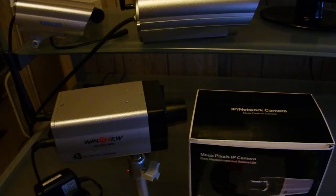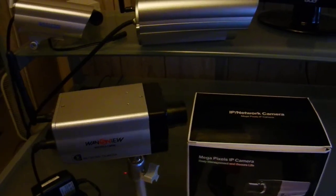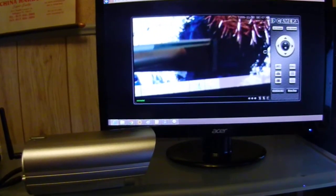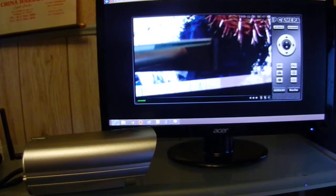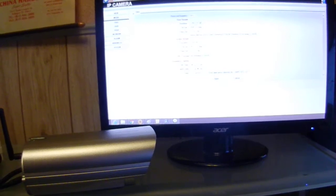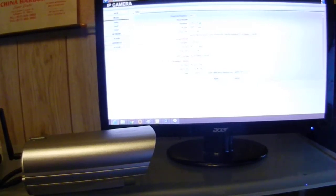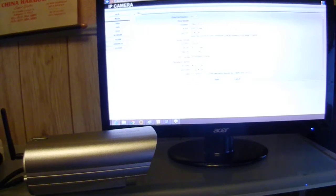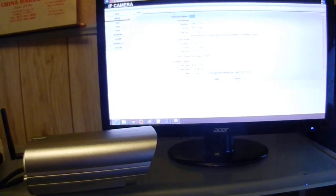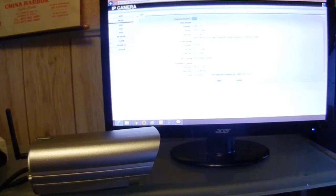The camera is a great little camera — it's got a nice interface. You've got record buttons, snapshot pictures, and you can change the video streams in the menu. You can see the resolution here is 1280 by 720, with a bit rate of 2048 and 25 frames per second. You can change the power line frequency between 50 hertz and 60 hertz, and then you have a secondary JPEG stream.